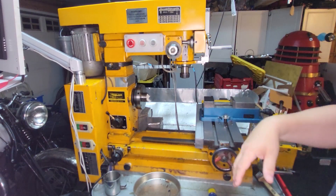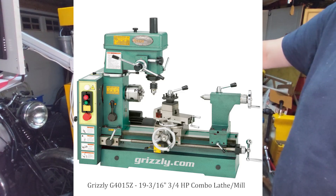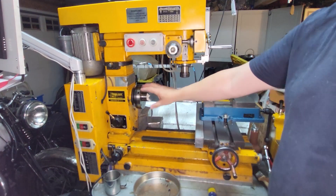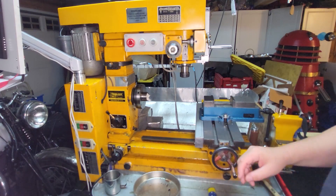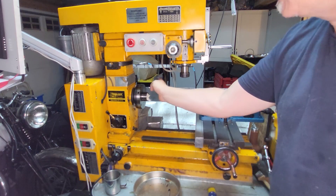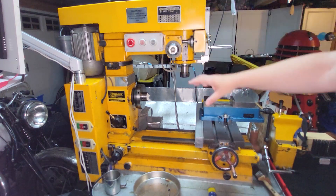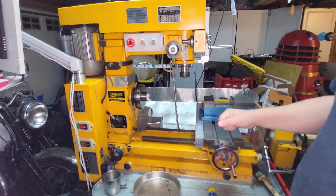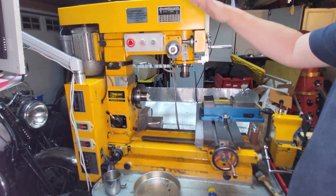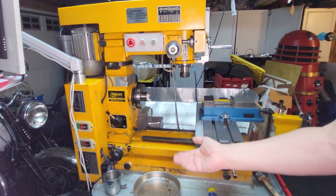There's also a smaller format I'll call the short head, where there's a single motor with gearing up to the top. Those have the spindle much closer to the chuck, so if you want to do any sizable work you're going to have to take the chuck off every time you want to use the mill — that's an extra level of inconvenience. Those also have a much smaller work envelope. They also tend to, depending on the model, lose some features. The big one on the mill is the heads don't go up and down, or if they do, they don't go up and down on dovetails — they'll go up and down on a pillar, or in this case not at all. That means either you're stuck with no head movement, or you have to re-zero every time. It's not like on a proper mill where you've zeroed your work and you can raise the head to change a drill and still keep your zero.